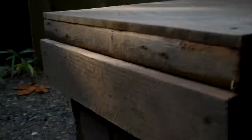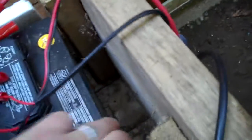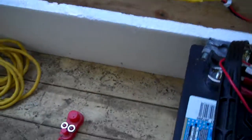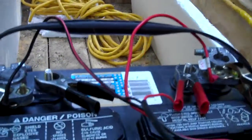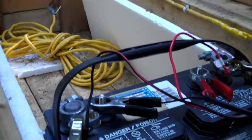This is my battery box. The wires go in under here — that's where the ventilation is. Inside I have one battery to start, with room for four more. It's a Kirkland Deep Cycle 95-amp-hour marine battery. You have to use a deep cycle battery because the sulfuric acid in a car battery will erode all the plates inside if it's discharged — a car battery needs to stay fully charged, whereas a deep cycle is built to handle a certain amount of discharge.